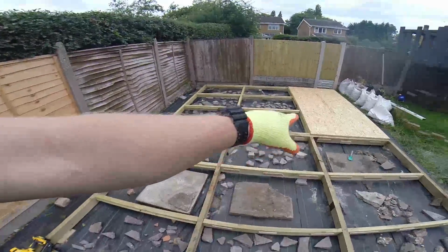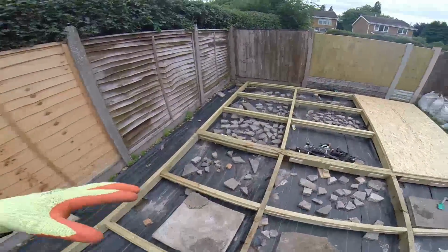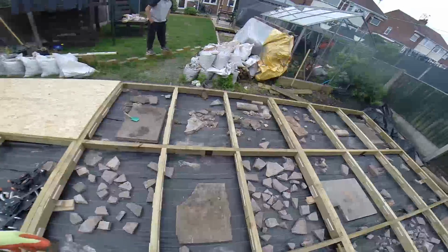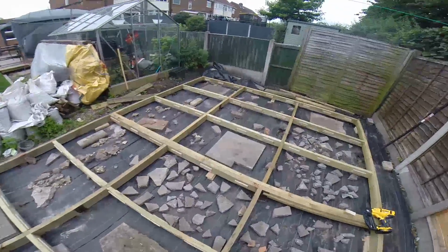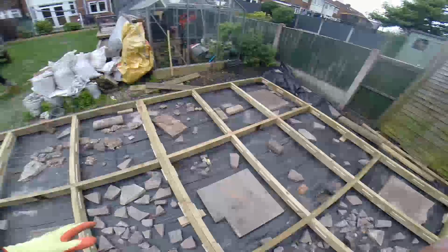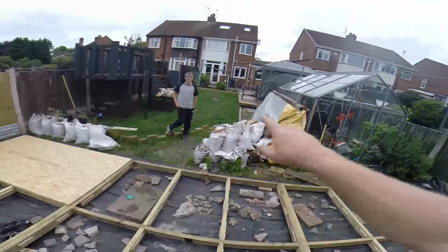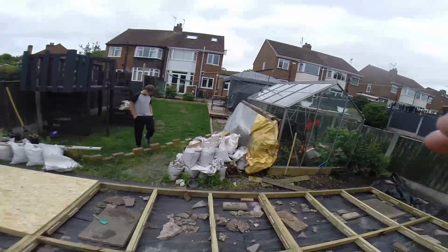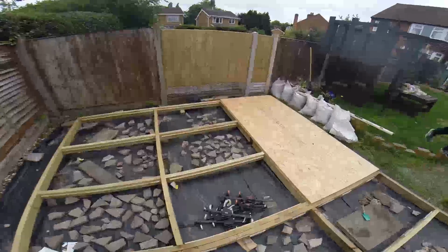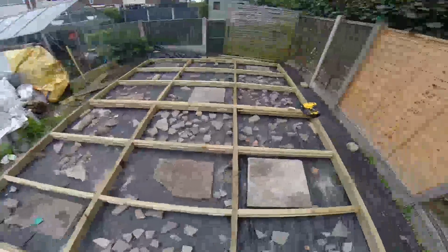Then just attached the base anchors every 4 feet spacings, and then the holes directly underneath the anchors get filled up with concrete or with postcrete or postfix or whatever, and that's really good. That's exactly the same process I did on a test run on the deck that I've built, which is a 12-foot squared deck, and that's solid as a rock. So I was quite happy to bring that same process down here.